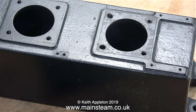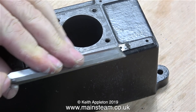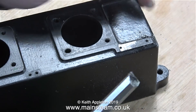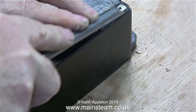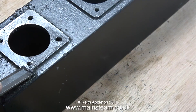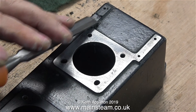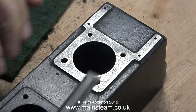I'm trying to hold back my excitement about the next part of the job. I'm going to scrape all the paint off the parts where the column and the cylinder fit, not forgetting the area where the valve linkage bearings fit. I don't know what type of paint this is — all I can say is it's very well stuck to the base. I'm having to use a chisel to remove it; normally I could use a ruler, but the ruler just skated over the top. This is a brand new sharp chisel, and I was quite surprised that chipping off the paint was blunting it — I had to sharpen it on wet-and-dry sandpaper a couple of times. I finished off the job using a piece of Scotch Brite.